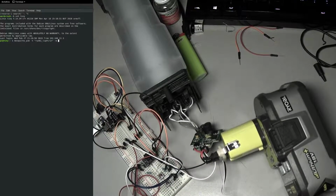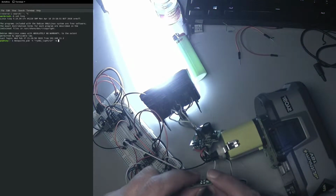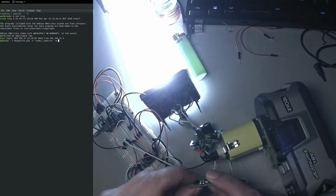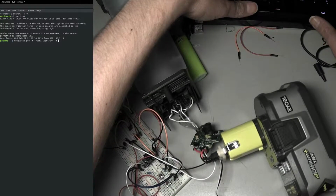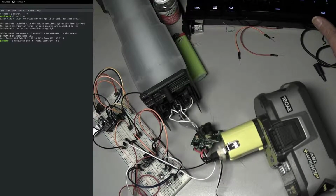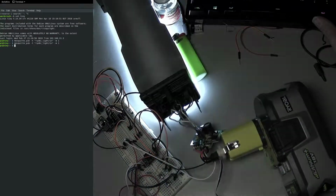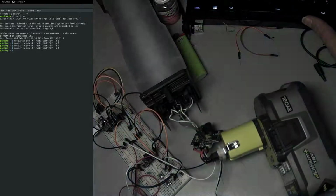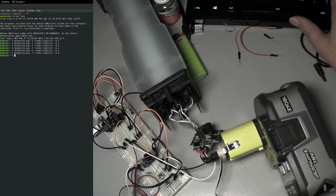A long press of the normal button just shorts these terminals and it turns it on. If you press it again, it toggles through the different lights. And if you do a long press, it'll just turn it off. So essentially, I coded that so that it's listening on this thing, and it can toggle on, or you can just use that to toggle through the states. Or if you want to give it an explicit off, you can just send it a 0 and we do one long press and that turns it off. And I don't even know if I did that right.